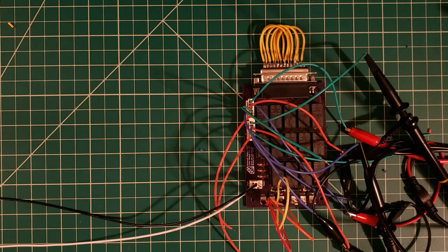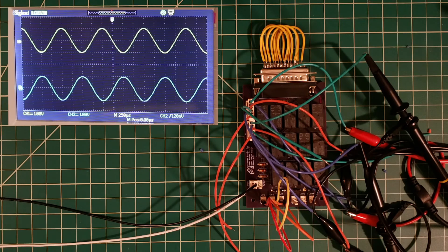Our final test is very similar to the last one except I've also closed the flip switch, so all three switches are now closed. When I apply 24 volts to the board, all 14 relays should fire and we should see no change to the signal on the oscilloscope — meaning the signal flows through the input to insert number two, then back to insert number one, and to the output. Applying 24 volts — all relays fire and we see no change. For our left channel, all signal routing appears to be correct.